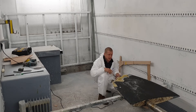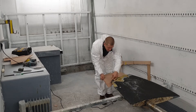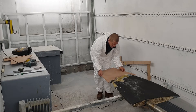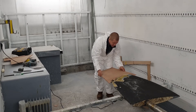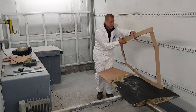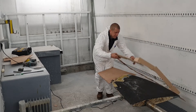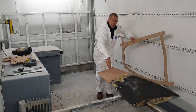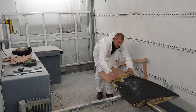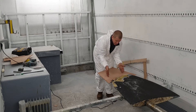That gives us something we can fix a plate to. Next, we've got a piece of timber underneath - drew around the shape that existed, cut that out with a jigsaw - and what we can do is just slot that into our groove. Once I glue it in, it's perfect. We can just lay this, line it back up in the right place, draw around it, and suddenly on the set line of the rudder we've already got our correct outer shape. Then all we do is put the filler work on to try and get it blended back in. You want to get your nice set line around just so you've got the correct shape again.